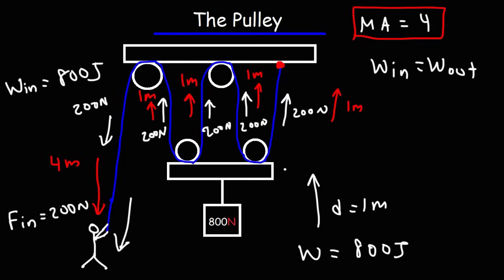There's something else to note when dealing with this type of pulley. In an ideal situation, each of these ropes will move up by the same distance. But if you were to actually try this experiment, you'll find that the ropes on the left will move more than the ropes on the right, and this rope may not even move much at all — this particular pulley might be tilted towards the left. In an ideal situation we assume all ropes move up at the same time, but the ropes on the left will appear to move more in the upward direction for the simple fact that they're closer to the pulling rope.